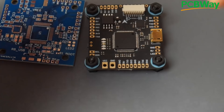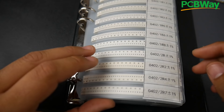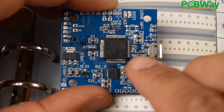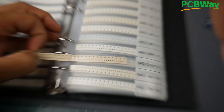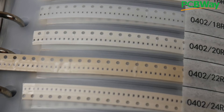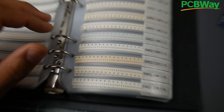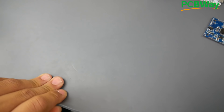For building a flight controller, the standard size I'm sticking with for resistors is 0402. You can get a resistor book from Banggood — for example, we needed two 22-ohm resistors for the USB. All you do is go through the book, find the 22-ohm resistor section, pull it out, and those are ready to use. I already used some to build my first flight controller. You apply solder paste, place them, and heat it up — I'll show that in a later video. This book is very cheap and will build you a ton of flight controllers.